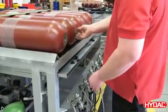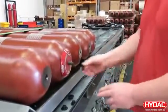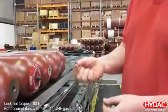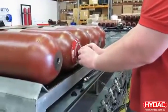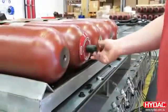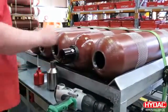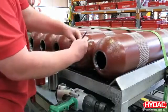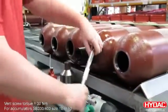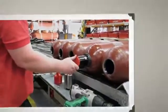We can remove the lock nut to fit the identification plate. The lock nut is then tightened up and torqued correctly. An o-ring is then fitted around the gas stem — this forms a seal against the cap. A plastic safety cap is fitted for protection. The last operation then is to fit a vent screw onto the side of the fluid port. Check the service data for the correct torque rating. Finally, a plastic protection cap is fitted for storage and shipping.